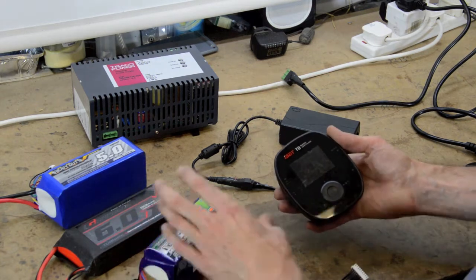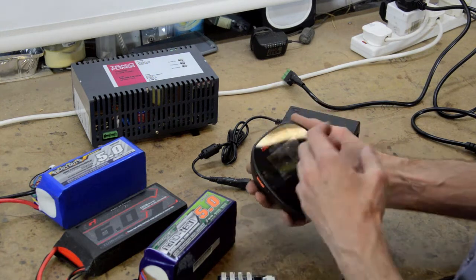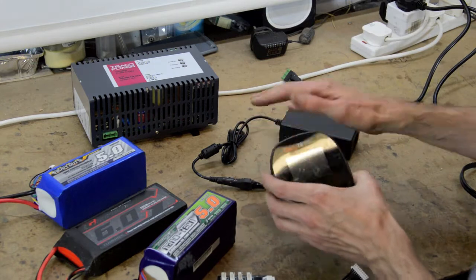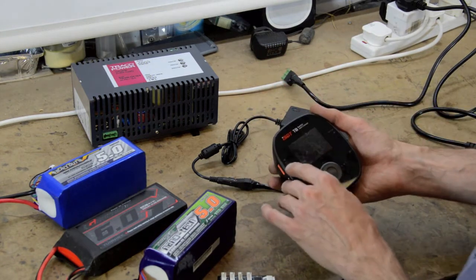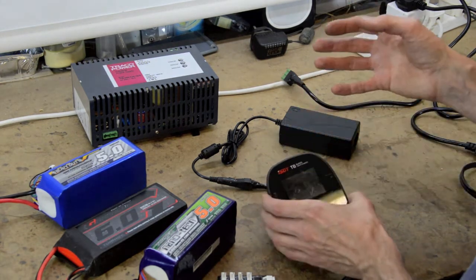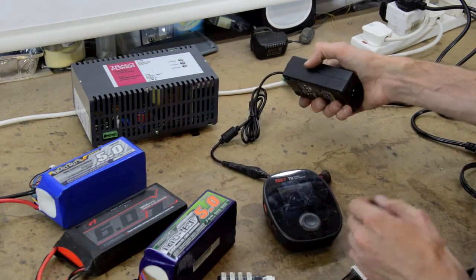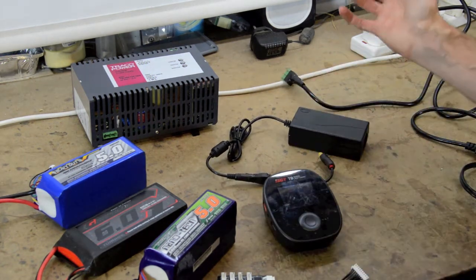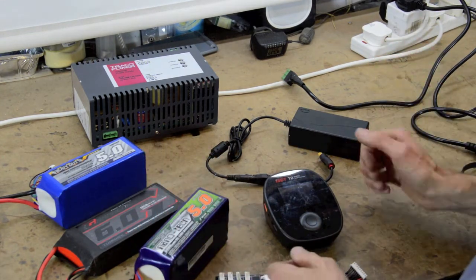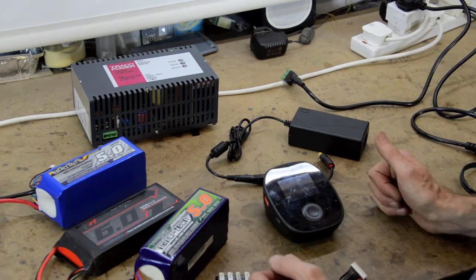Because it's designed to sell in every country, they don't sell it with a mains power lead. All it says is input 12 to 40 volts. So I thought I'd just buy a cheap 12 volt charger, plug it in, and hey presto I'll be able to charge my 8s battery. No - it doesn't allow you to do that. It just trips out and doesn't like it.